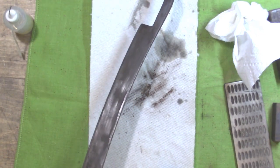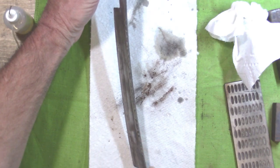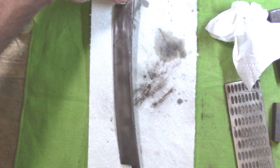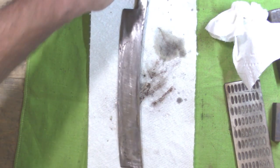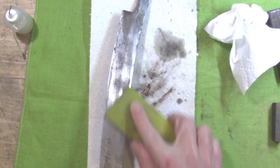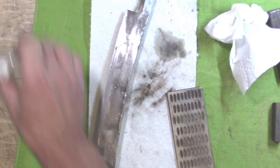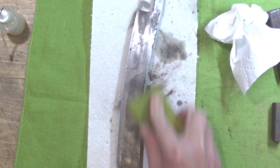What I've got going here — I noticed the top of the blade, or the back side of it, has been hammered on. So it tells me this was used like a froe, which you can do. But if you're going to hammer on it, don't hammer on it with a hammer — use something wooden, where it doesn't beat up the metal as much. It's raised up, kind of a ridge there, that I'm trying to get out with the diamond tool. I could file it, but about the time I do that I'd end up having to polish out the file marks anyway. So we'll see — I may end up doing that if this takes too long.